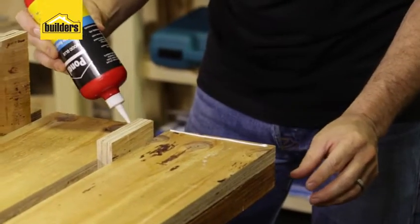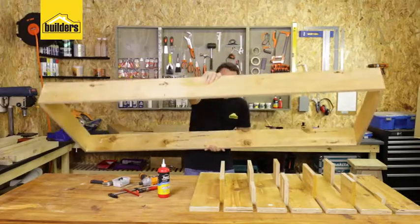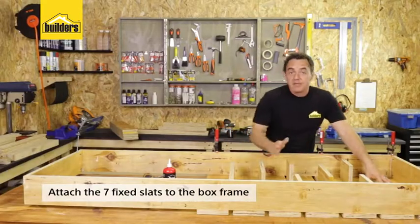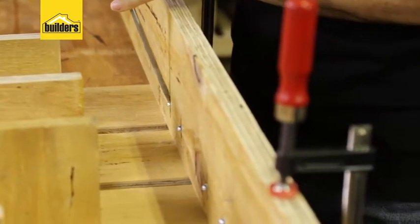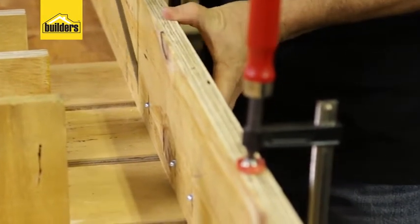I'll put some wood glue on both sides, the framework comes back in and we place it on top. That's all clamped into place with equal spacing on every single slat. I'm going to get a production line going and get all my Kreg screws in and drive them down into the timber, double-checking that I still have a flush edge on the outer surface.